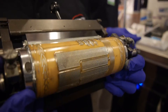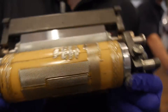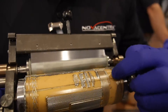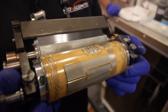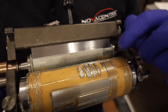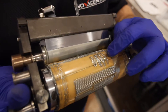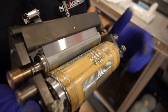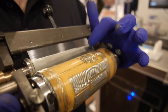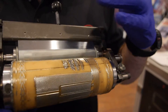So what are we looking at here? This is a Flexo QD proofing press — a flexographic press. Here you have a rubber stamping plate, actually a photopolymer rubber. It gets inked by the anilox with silver ink, which transfers onto the high parts of the stamp and then onto the film. Using the anilox we can determine how much ink is applied, and the doctor blade ensures the anilox is metered properly.